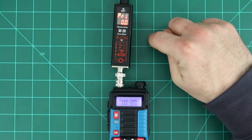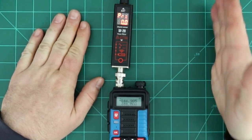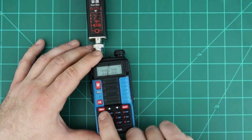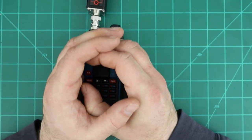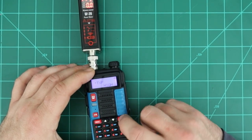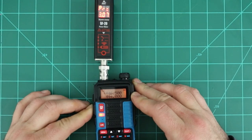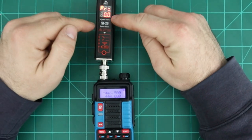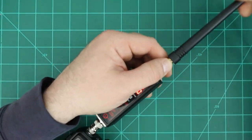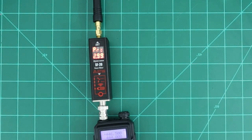So we went from about 5 watts on high power to about 2.5 watts on low power. Here's 60 watts — and here's where we actually are. Moving over to 446.500 MHz on UHF, and noting that the keypad does illuminate. Setting power to high and transmitting — W9FFF testing — right at about 3 watts on high power UHF. Swapping to the stock antenna and testing again: still 3 watts.